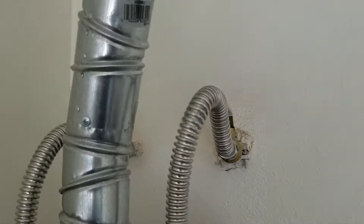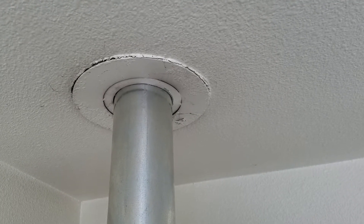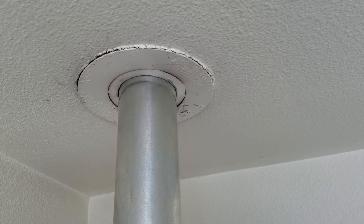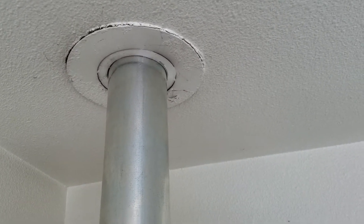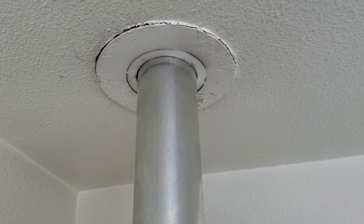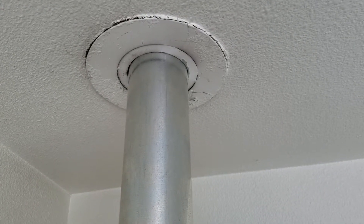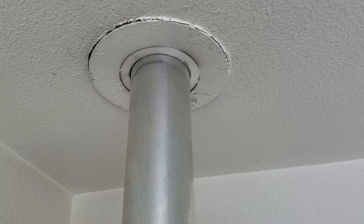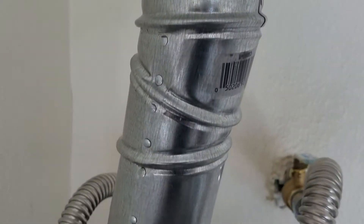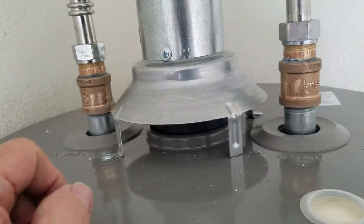What we did is we replaced the vent piping all the way up. The only thing I don't like about this is the existing dual-wall B vent that's in the attic is pushed up about two to three inches into the attic space. It's sealed up at the roof flashing where the pipe penetrates the roof, so we couldn't pull it down. We usually like to pull it back down and get it on top of the ceiling bucket, but we couldn't move it. So it's sealed up top — it's fine. We just crimped it and slid it through. Normally that just penetrates about an inch and a quarter to an inch and a half into the ceiling bucket; it's up there about two to three inches. Anyway, the piece pipe is new, the two offset 90s are brand new, straight from Home Depot. The draft diverter comes with the water heater.